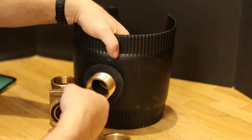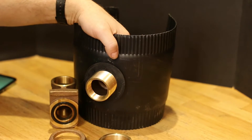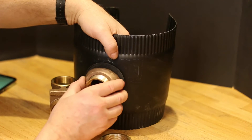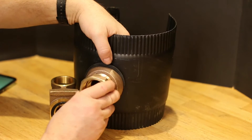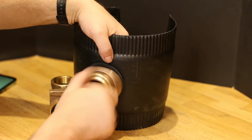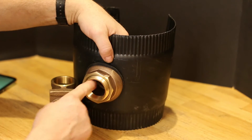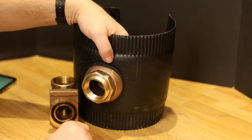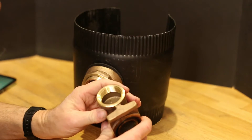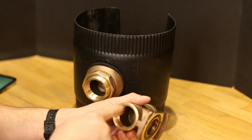You can put a piece of pipe in here to hold it while you're working with this so it doesn't fall down or push back into the well. Then there's an adapter here that's curved to the shape of the casing, and that goes on next. Then your lock ring places and threads inside here that your poly pipe adapter screws into.